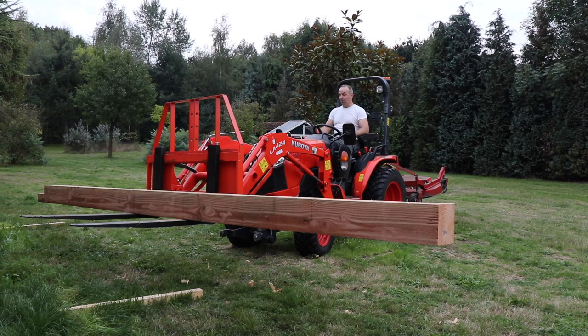When you have a compact tractor with pallet forks, you can also take up a long beam and travel it around, but see how wide it is — it's very impractical. You can't even move through a normal gate opening when it's 3 meters wide, and this beam is 5 meters, so you hit stuff. It is much easier to transport it in the length direction than in the wide direction. That's also why I prefer this long beam transporter over something like this.